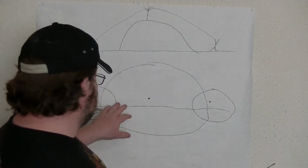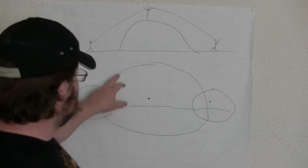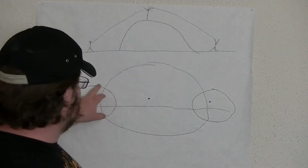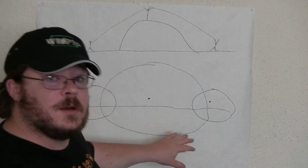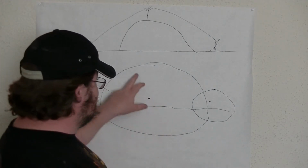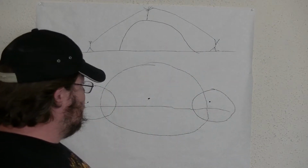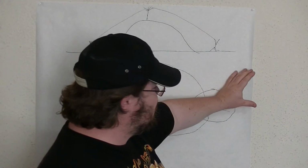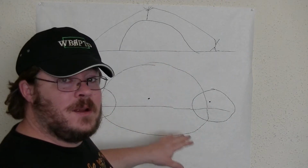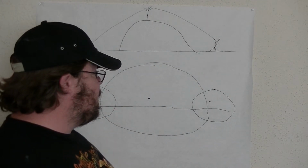And the radiation patterns and stuff that I'm showing you, they're not always a circle. I mean, there's different antennas. There's beam antennas, and usually it's all jagged. You know, it's never going to be a perfect circle. But an omnidirectional antenna, which is kind of what we drew here, will put out a round pattern on the radiation pattern. Like I said, it's not going to be a perfect signal. It's going to have jagged edges and stuff. And a beam antenna will put most of the signal out the front of the antenna, a little bit out of the back, and it might have a little on the sides depending on how good your antenna is. So anyways, I hope this kind of helps describe what a repeater is.